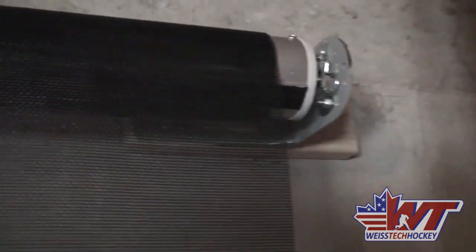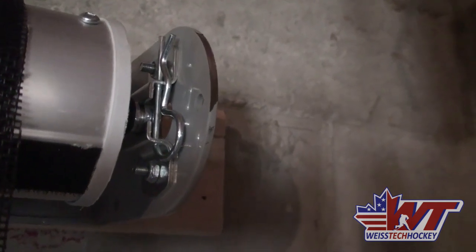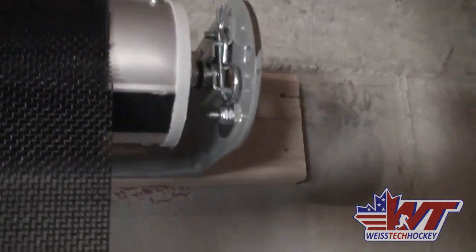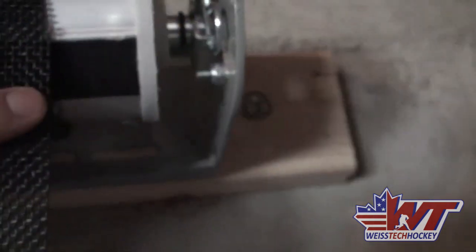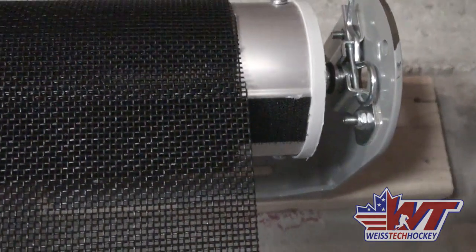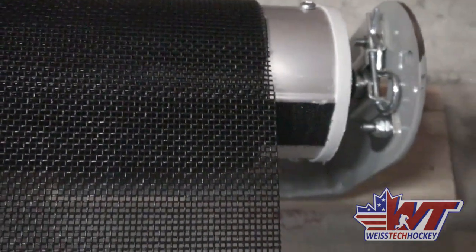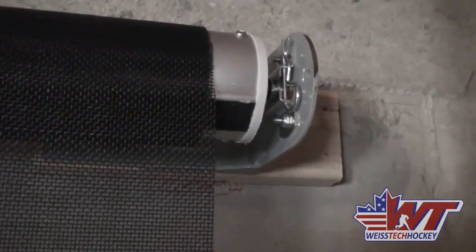Instead of drilling straight into the concrete, I just attached a 2x4 using the nail gun and then drilled straight into that. It's really sturdy and not going anywhere — easily strong enough to hold the unit. Also make sure you use the cotter pins that come with the setup so the tube isn't going to slide out eventually. After that you mount the brackets, measure and mark, slot the header tube in on both sides, and then the actual tarp attaches with velcro. It's longer than it needs to be so you can make adjustments if you need to mount it a little higher.